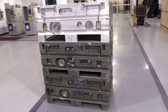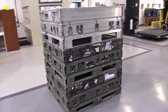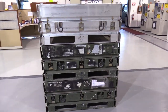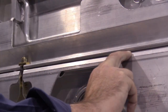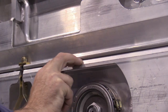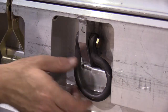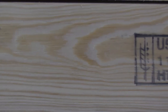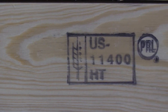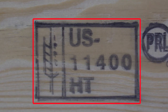As you walk your way around the LLRC, check the following: the container should be structurally sound with no penetrations or corrosion that would prevent a water vapor-proof seal. Make sure the mating surfaces are flush. The mating gasket should be seated properly in its channel so that it does not overhang the lip of the container. Verify all mating hardware is present and appropriately tightened to maintain a water vapor-proof seal. Lift rings and handles should be securely attached. If the LLRC is equipped with wooden skids, verify they are in good condition and all skids have a WPM stamp indicating the lumber has been heat treated.